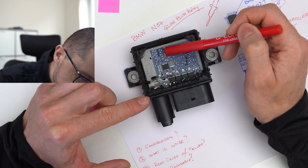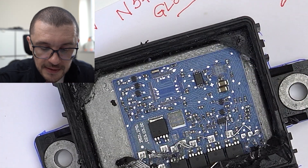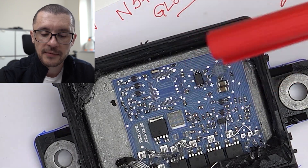Based on the shape of those contacts, I would be tempted to think that it was an issue with the microcontroller. Overall, this is an example of interesting engineering, but engineering that does not really allow for the component to be repaired. And maybe the cost of this component doesn't even justify that type of repair. I hope this video was useful — at least for me it was interesting to find out what was inside of this glow plug control module. If you find it interesting, don't forget to consider liking and subscribing.